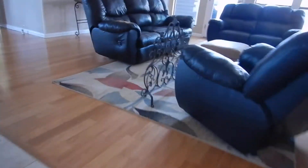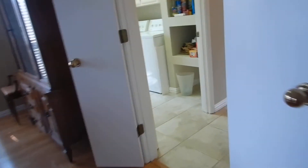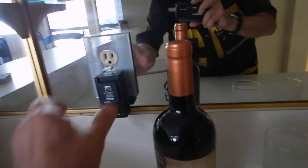I was looking for a half bath — for a flat of this size I kind of expected to see one, but there isn't one. This is the wet bar. The wet bar is not GFCI protected.